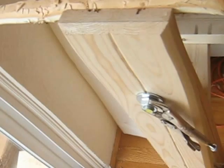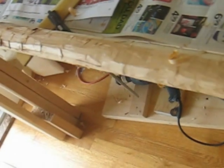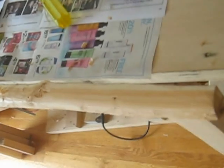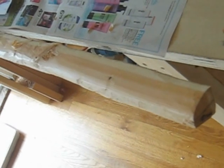I started to work with it on this piece of yew wood which I have been saving since last fall. It's now June, so I've had this thing since September — about 9 months or so. And you can see it's got almost a 90-degree twist. On the other end the inner grain is shooting straight up; here it's sticking out maybe 45 degrees or so, and that's pretty sharp. It kinks severely back here — it must have been a knot. So this one's going to require being thinned down and then heated with weight on it, set up in such a way that as the heat plasticizes the wood, the weight will drag it in the desired direction until it's stabilized where I want it so that the thing looks straight or just past straight.